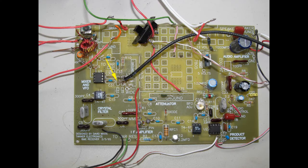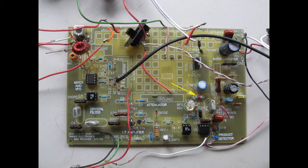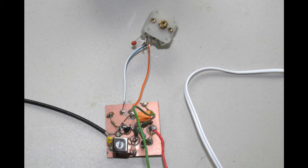Real cool. This is where the DDS VFO signal comes in. This is where the 455 IF comes out. This is the little test point I use to verify the mixing circuit. This is a little ceramic resonator BFO circuit — close-up.